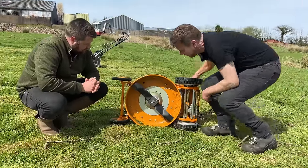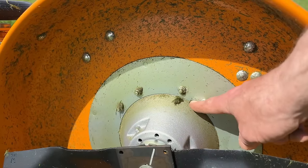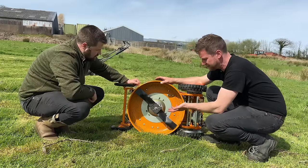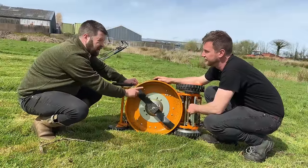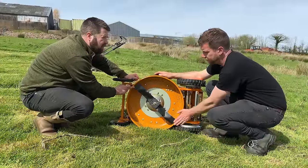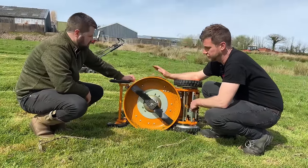The AS Motor — even cleaner again. All the coach bolts have the smooth side down. You can see a tiny bit of grass build-up where anything protrudes from the bottom of the deck, which will accumulate more over a full day's work. The blade on this one is also closer to the bottom of the deck than the others, which may give better results and the highest cut of 90mm. The Grin — again, that's clean. It's probably the smoothest deck shell of the lot. The bolts do stick out the bottom, but ideally recessed bolts would be even better. Very clean overall.